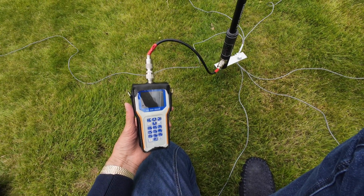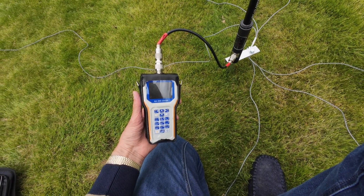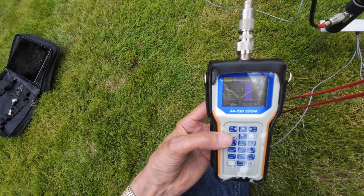To adjust the antenna for resonance I use the RigExpert Zoom — it's a very handy analyzer that I use all the time. I initially had it at 13.7 MHz approximately, but that was a bit high in frequency, so I then adjusted it to 13.3 MHz. As a rough rule of thumb, the reflector should be five percent lower in frequency than the operating frequency. So if your operating frequency is 14.1 or 14.2 MHz, you need the reflector to be five percent lower, and a director would be five percent higher — the same principle as a normal Yagi antenna.